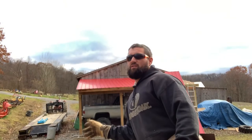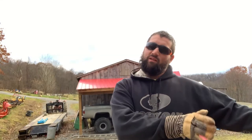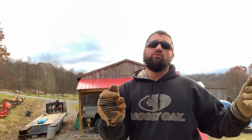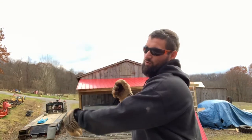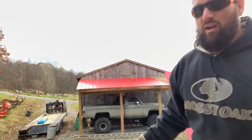Another thing you want to try to do when you're lifting these panels up there, they all go left, there's a left and a right side. So when you lay your pile, if you got two guys working on it or more, you want to make sure you're always putting the roof on the same way. You don't want a guy spinning around on you. Next thing you know, it ain't going to match up and you already got it on the roof. But that's what I do.